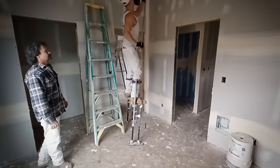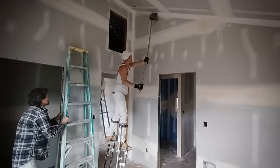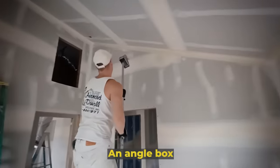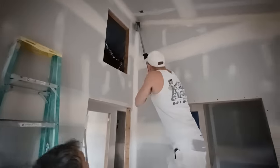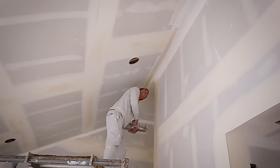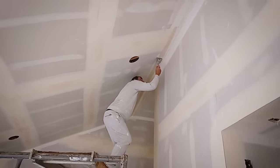You can see some really interesting equipment here. He's walking around on stilts so he doesn't have to move a ladder around as he finishes off this vault. I asked: what kind of tool is that? An angle box — you just fill it up with mud and run it. Second coat of top is going over the tape joints right now. It's imperative that we get these walls really smooth so the hand texture doesn't show any deflections in the wall.